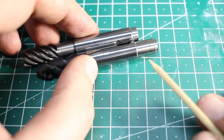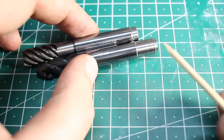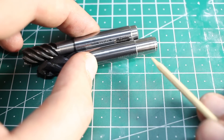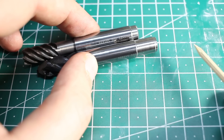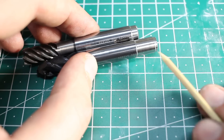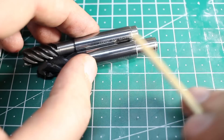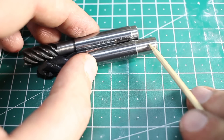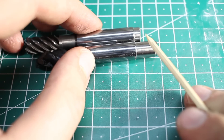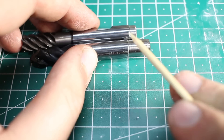The result didn't look awesome, and the insert he used was badly chipped. So I went in the shop, took a CBN insert, reground it as I usually do without an edge prep — so it has a sharp cutting edge. I did some test cuts and lo and behold, it works. Doesn't hold up very long. And the carbide dust is nasty, or the carbide chips in this case. But it works.